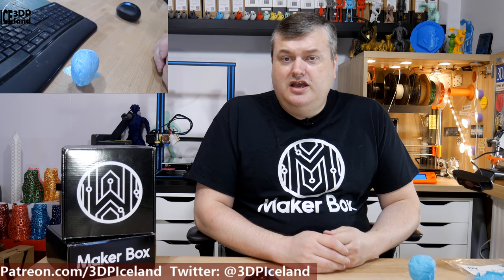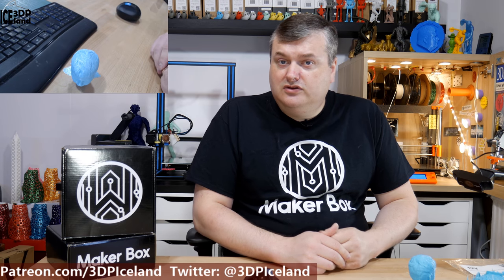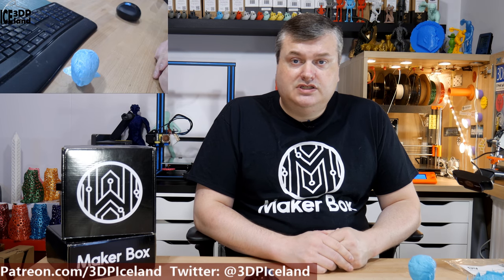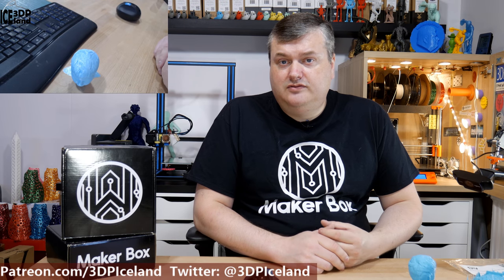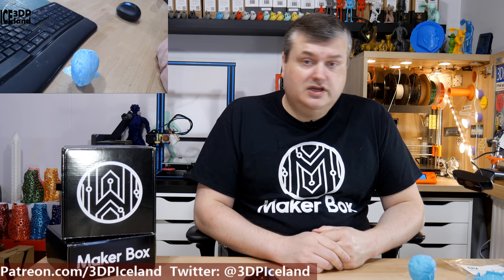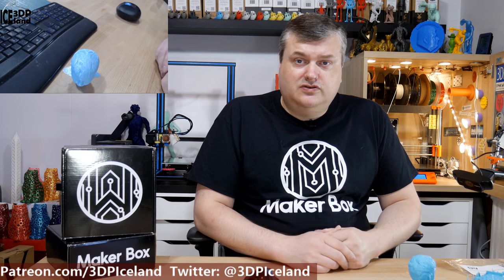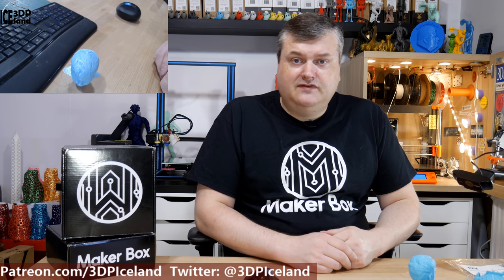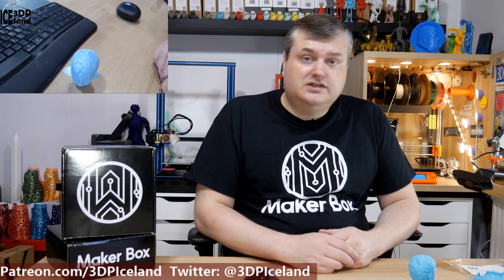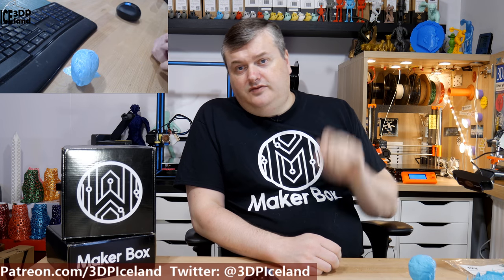So this was a quick look at the AIO Robotics PLA. I've already done a full review on my channel which had very good results — it was very easy to print at 205 degrees with normal PLA slicer settings, with good layer adhesion and a very good surface finish. They have a 12-pack with 12 different colors in half-kilo spools available on Amazon. I hope you liked this video — give it a thumbs up or leave a comment, and thank you for watching. See you in the next one.